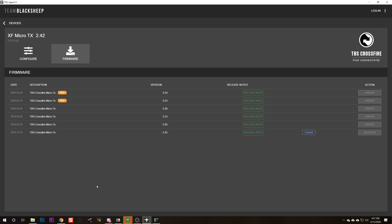Before we dive deep into this, let me give you the short version for those who just want to skip to the end. In order to try Crossfire Shot, you need to have OpenTX 2.3.5 installed on your radio. You're going to overwrite it with the nightly build that TBS is putting out, but that nightly build is based on 2.3.5. So installing OpenTX Companion version 2.3.5 and the 2.3.5 SD card contents will have you ready to go. Then you need to download the nightly build of OpenTX and flash that to your radio. There's a link in the video description.